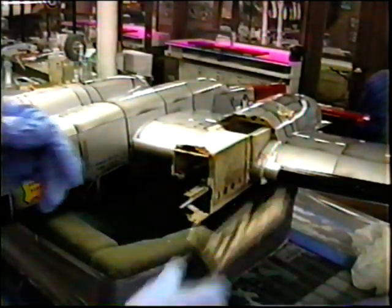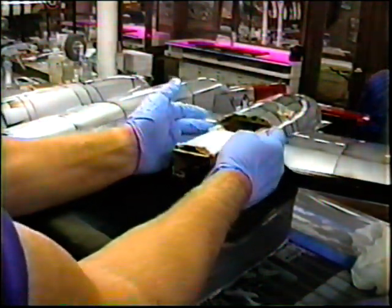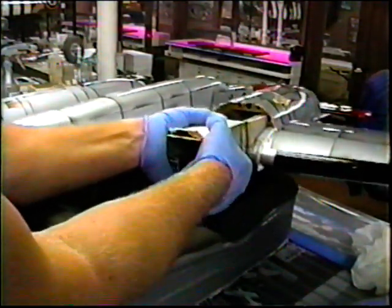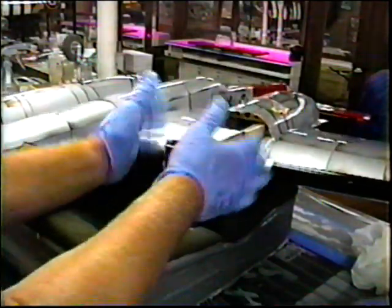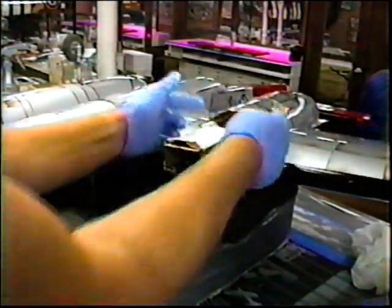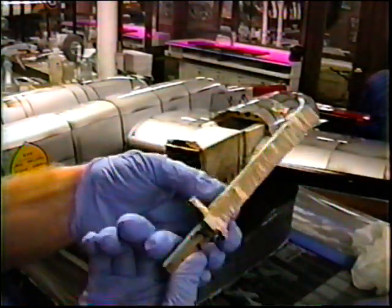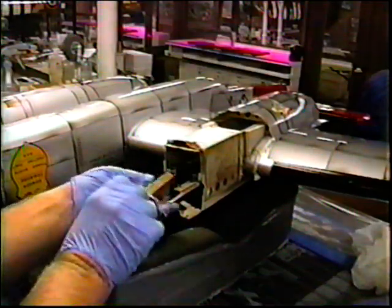All of this is the next piece I've got to jig. It's just a jigsaw puzzle. I made two doublers on both sides of this because I want to be able to pick the whole plane up by this. This has to be relatively strong because the outer skin is really more cosmetic. So I've been making them one piece at a time. This is the next piece, and I've got to fit this in.